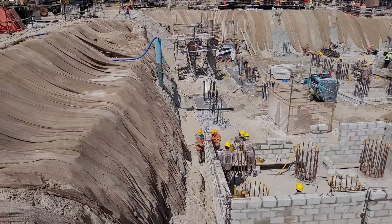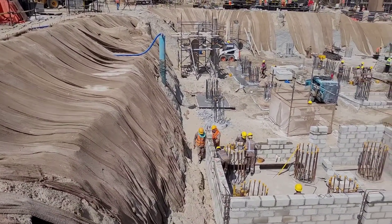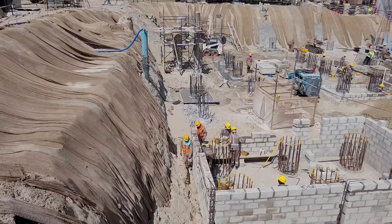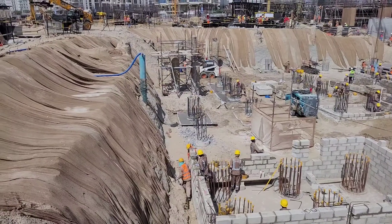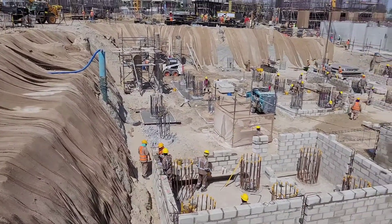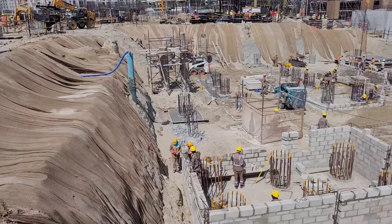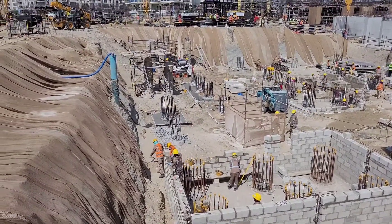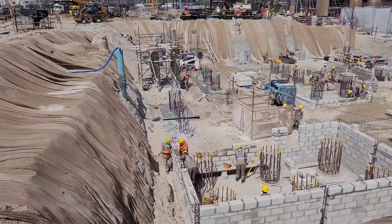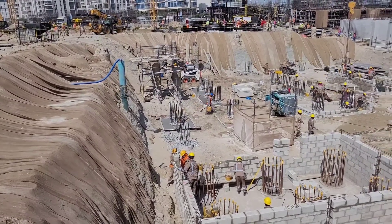You can see these excavations at a 45 degree angle so that loose soil should not come down. Then dewatering. Nearby one pile, blinding has been done. In India, blinding is called PCC — plain cement concrete — for waterproofing purpose only.